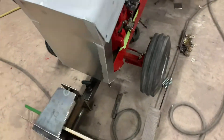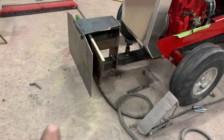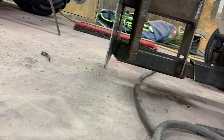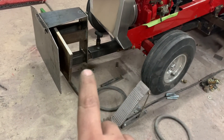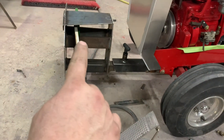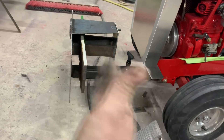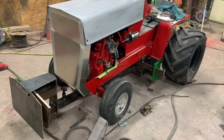I still have to drill some holes in the top of this so the pin will lock. I'm a little disappointed with one layout issue — I didn't run the eighth-inch plate all the way to the bar, so if it hits the track it would scoot across. When I laid out this piece I ran it to the bottom, so I didn't leave enough material, but that'll still lock those weights in there. I'll probably drill a couple holes so you can throw a pin in so the weights won't slide forward and back. I've got a buddy with a CNC plasma cutter who said he'd cut some more weights for us.